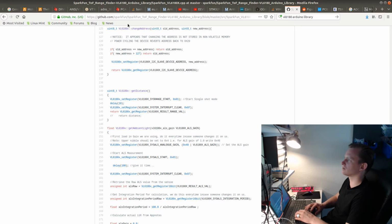So I'm going to set addresses from the device tree. I'm going to configure the addresses through the device tree, and then I don't need to do the begin and the end. So I don't need to restart. Actually, that's very important because if I restart the sensor, I toggle the enable pin and put the sensor into power down mode, and I'm not entirely sure if the configuration is kept. If it is, then getting it out of power down mode and continuing to use it is fine.